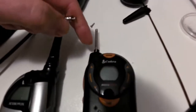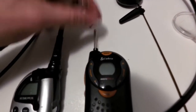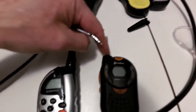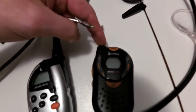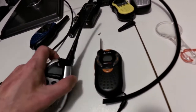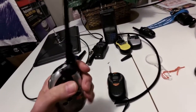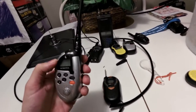To get the measurement, you can take the radio apart, or when you have it straight, just take a toothpick or something like that and measure how far it is from the top to the circuit board, then subtract that from your total length — because you want your total length to be six inches for FRS. It definitely improves the range; receive and transmit will both be better using this method.